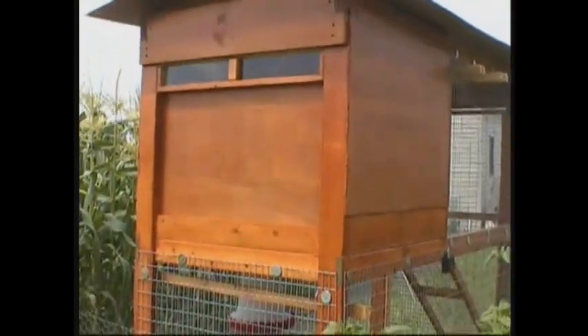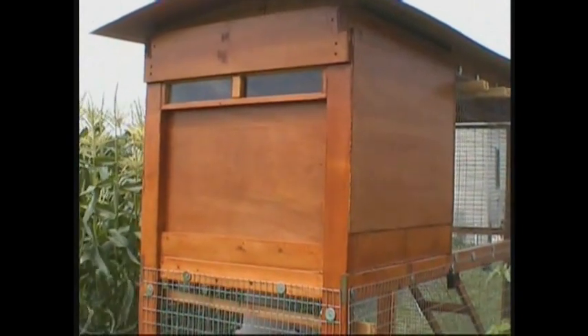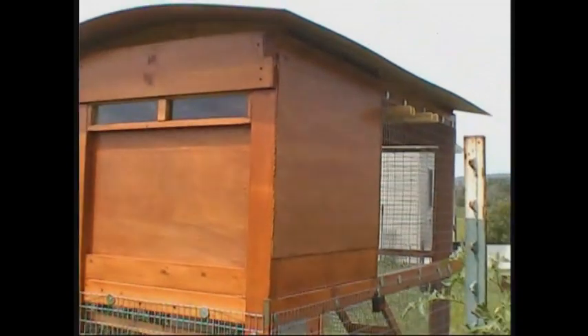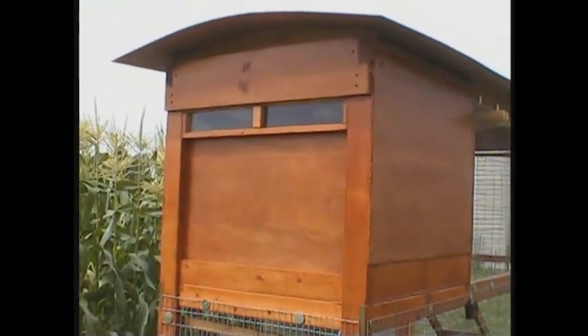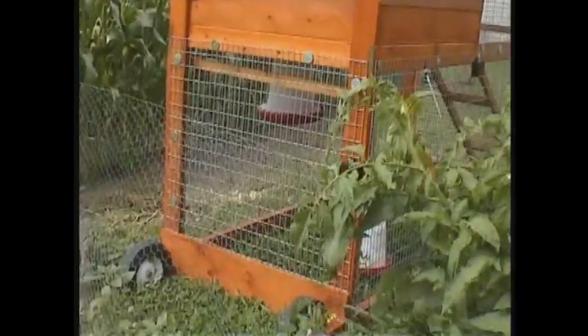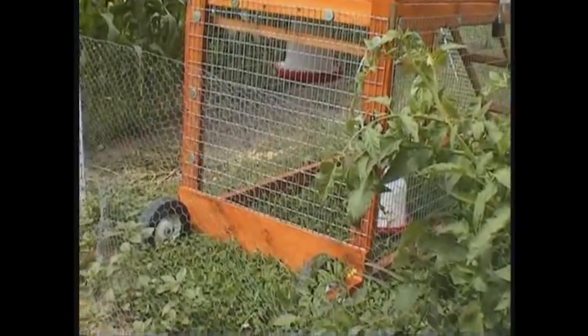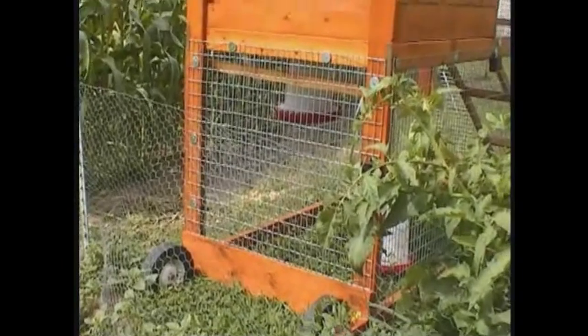From the end where the wheels are located, you can see a window at the top of the three-foot by three-foot by three-foot box. The roof is 3/8-inch thick material, arched, four feet by eight feet long, covering the coop from one end to the other. The rest is 2x4 material with 1x10s at each end for structural support, and the entire thing is finished with exterior wood stain.